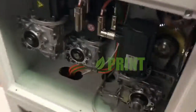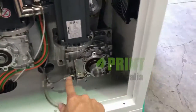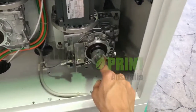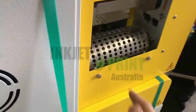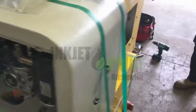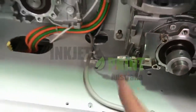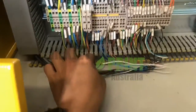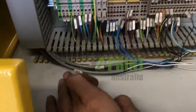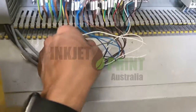We decided earlier in the video to use the proximity sensor which is connected and detecting the nut on the shaft of our cutting jaws. That cable is 5sq1 — it's gray — so we need to go to the control box and find 5sq1. If we see the tag, it says 5sq1, so we need to split the signal from this cable now.